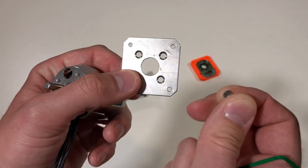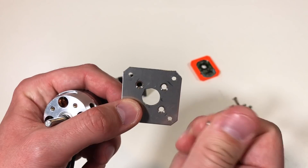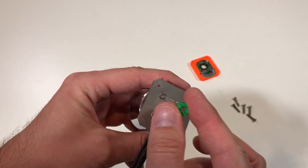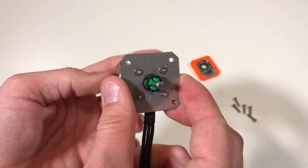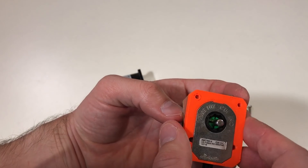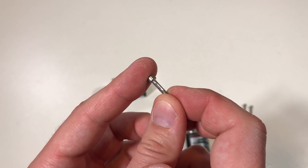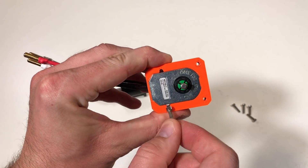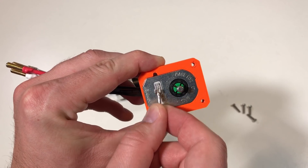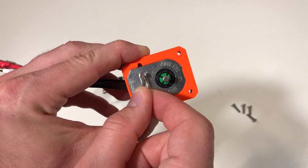To fix the metal plate to the motor I'm going to use small screws with a conic head — that way I take less space. Now I need to fix the collar for the encoder. I also filed two screws slightly, because otherwise they don't fit here and here — the casing of this encoder is just a little bit larger than the distance between the two holes.